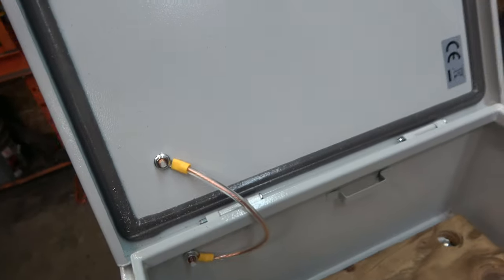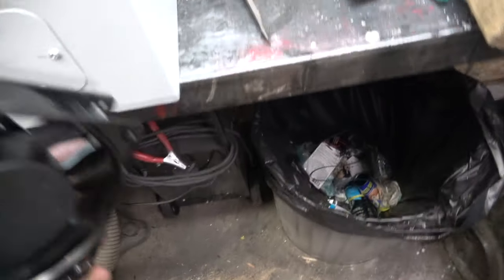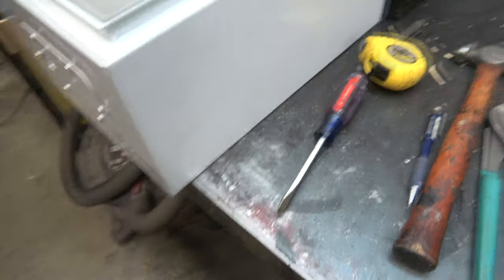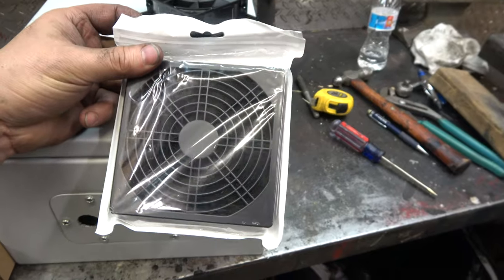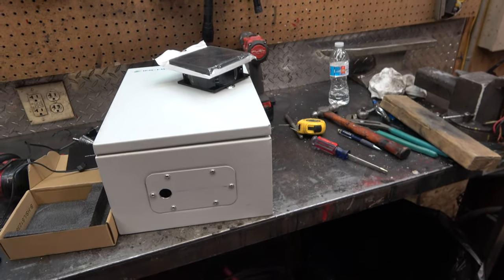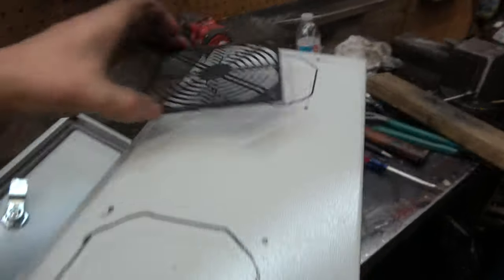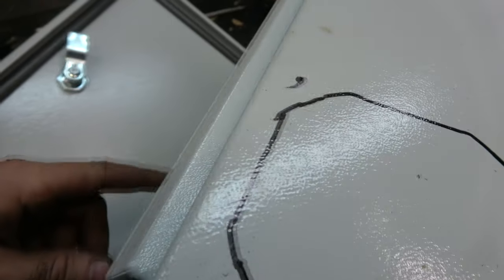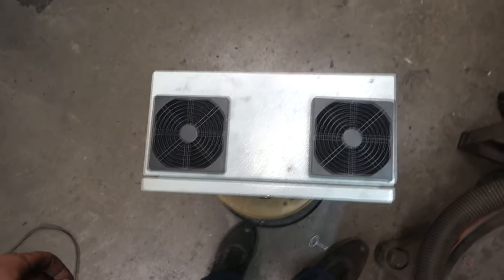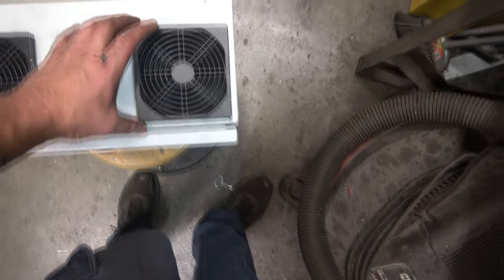This VFD is supposed to have adequate ventilation — it has a fan in it. This box is supposed to be sealed, so I'm going to somehow get air cycling through this whole deal. I've got this filtered grate — I watched a couple other people's videos trying to come up with the best possible approach. It sucks from the outside into the bottom to pressurize it and then exhausts up here. It looks a little rough underneath, but it's all deburred and should be fine with the cover on.